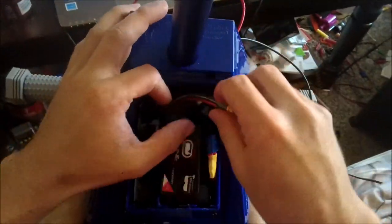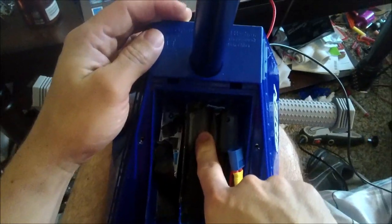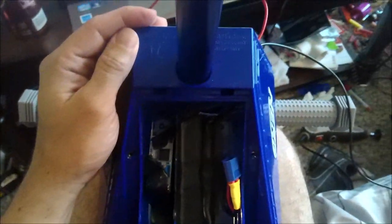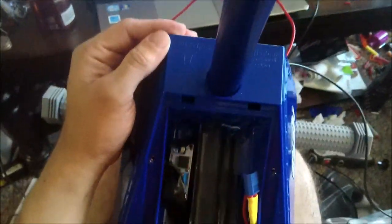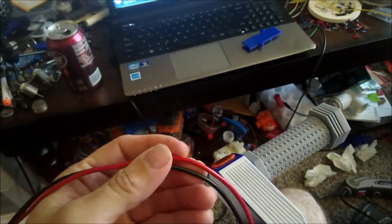Okay, this update, we have our, where did I set my battery? There we go. We will have the LiPo sitting here, XT60 plug right there. Under here, we have the two leads soldered into this plug. One of them goes off to the voltage regulator over here, dropping it from the 3S to 9 volts, and then that in turn feeds that to the main contacts for the blaster and everything else. Then the second set of leads will exit out here, and once I add the last XT60 connector, I will use that for feeding main power into the blaster so that the regular power circuits can turn everything on after you've signaled it. And let's just get this assembled and take it outside finally.